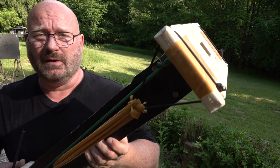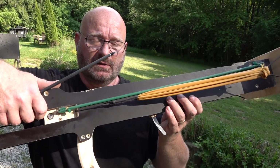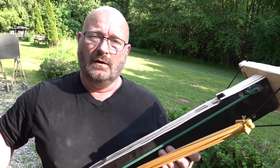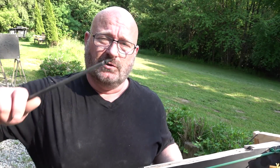It's a bullpup system, as I said. And the bullpup system makes it possible to really have a pre-stretched rubber. So this is the relaxed condition, and it's already under a lot of tension. And this is the difference to a short slingshot crossbow, since it is the pre-tension that makes it possible that the entire power stroke is able to transfer energy to the arrow.